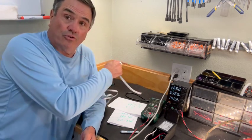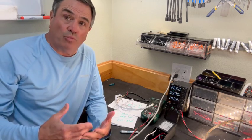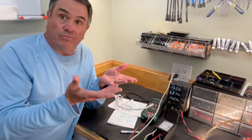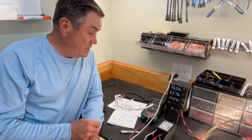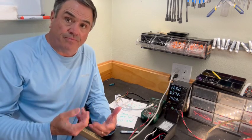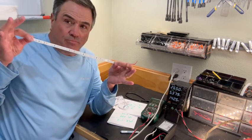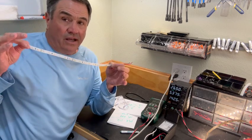Your chips are going to last a lot longer and your power supply is going to run very cool. It'll run more efficiently and you're not overdriving it and risking burning your strips or your power supply. You need to know the voltage of your power supplies matched up with the wattage of your LED strips. It's important to get a good, safe system for your home. A perfect wattage for a residential lighting system is 1.5 watts per linear foot.